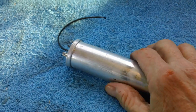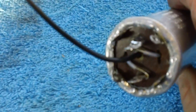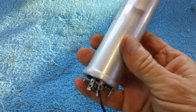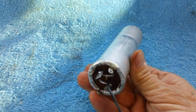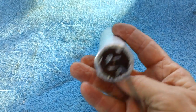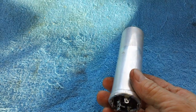There it is all finished and put back together. Folding it over, you don't get a real neat job out of that, but there's not a whole lot you can do about it - soft aluminum just makes it difficult to work with. It looks pretty good from the side though, and this will be down against the chassis so you won't see it. But I am not a fan of doing it that way - I will not be doing it this way anymore. The reason is the same one I expressed earlier: the next guy who comes along maybe 20 or 30 or 40 years from now will have a very tough time opening that can again - it'll really be destroyed the second time around trying to get that lip back up.